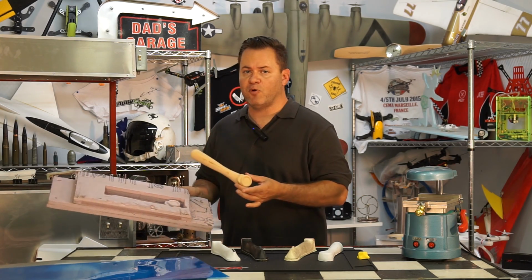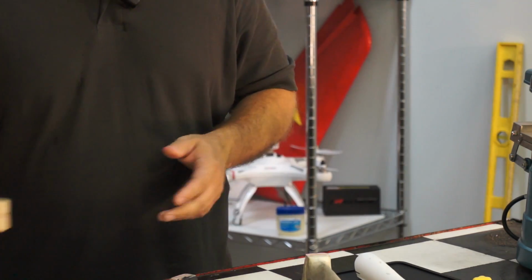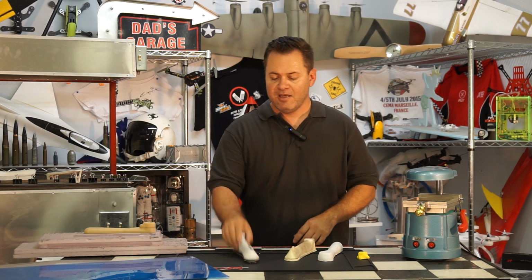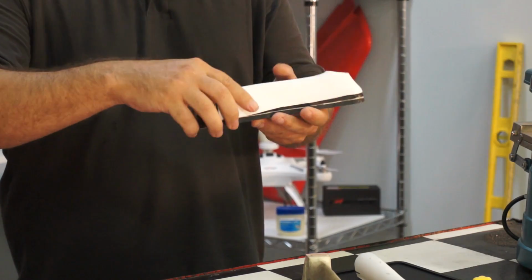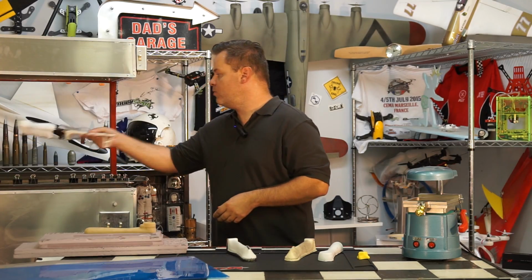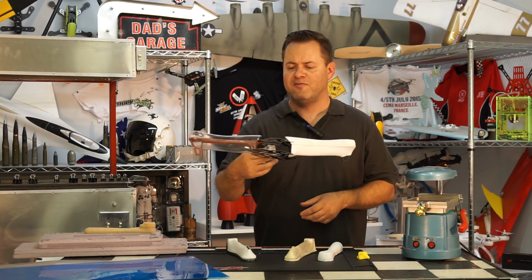Now, when I first started in vacuum forming, I actually had to CNC these molds out. And once you CNC'd them, you had to prep them with resin, sand them, polish them, paint them, prime them, and then wax them. And you can see the various stages here. And then you'd finally end up with something you could vacuum form, trim it out. And in this case, this is the lower arm to an F450 quad when I was vacuum forming body shells, when people were flying F450s around.